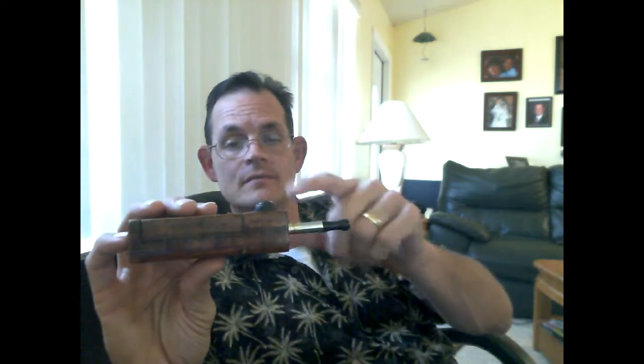The top of this, when I wired it, I was looking for an additional safety feature for myself. Before I put the switch in, I wired it all together, left the switch hanging out, and filled it with a non-conductive JB Weld. I wasn't sure if JB Weld was conductive or not. I had to make some phone calls. Hopefully the girl on the phone was right. But it's been vaping good. I haven't had a dead short or anything like that, so I think it's working fine.